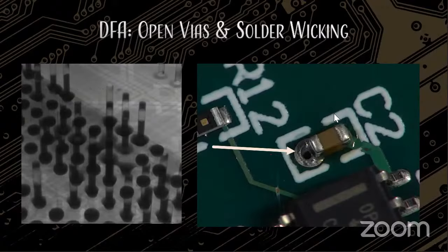There's a huge opportunity here, especially when you're looking at BGAs and LGAs — very expensive parts. The last thing you want is to have to rework these parts. It's so easy to lift pads and damage the via barrel just from going into rework by exposing it to another thermal cycle. You can completely mitigate that altogether by getting your vias filled. This slide alone generated a dozen questions — we have a separate slide on tenting and filling coming up in just a second.